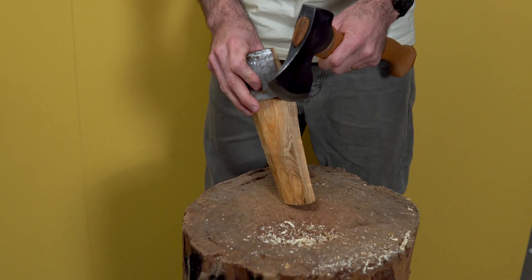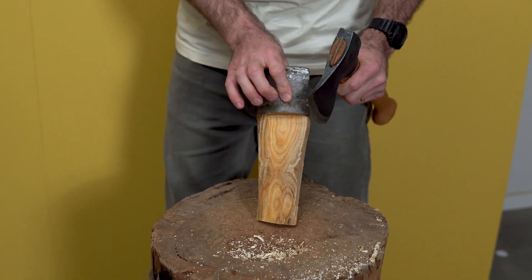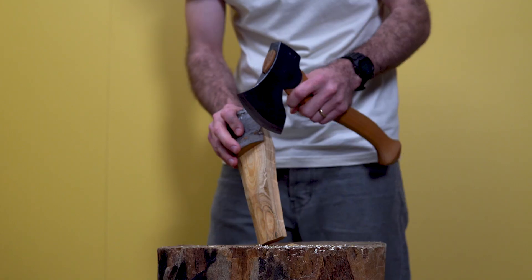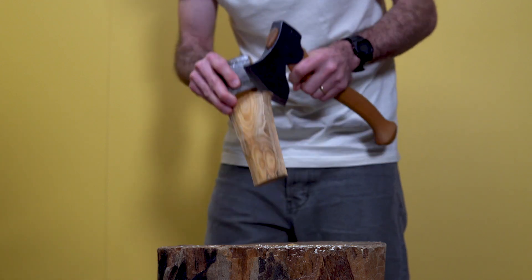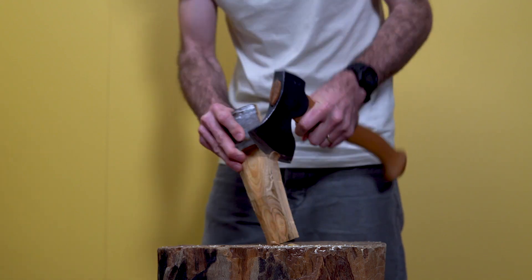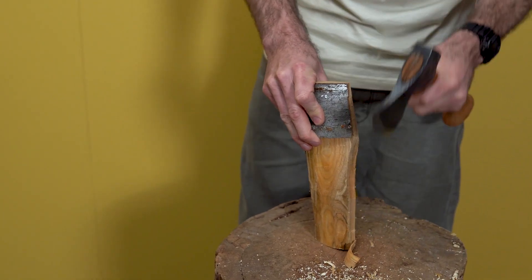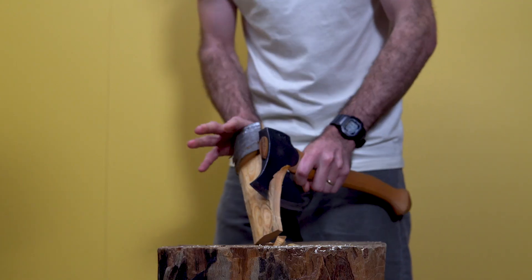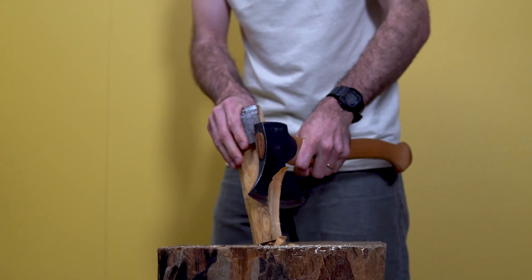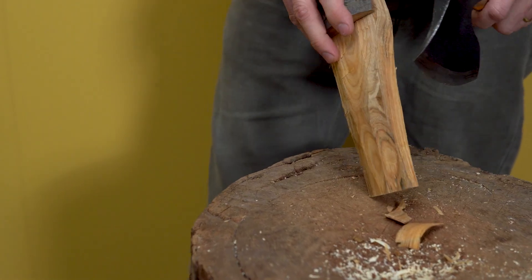Another really helpful tip is called a bump cut. If you want to get some accuracy on your cut — obviously I've got a lot of room to play with, but if I wanted more accuracy — I'd keep the blade on the piece of wood and then bump the entire piece down. That way, instead of trying to use that full swing, I'm keeping the blade out of my hands' way and giving myself a lot more precision to work with.